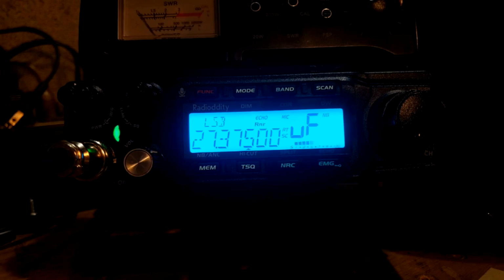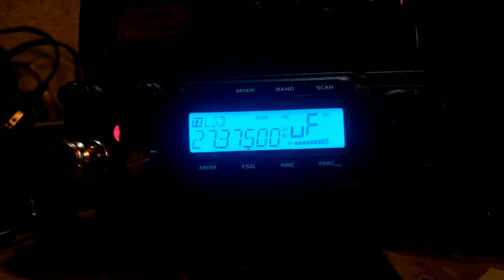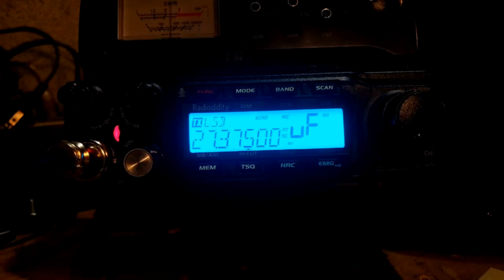No. Right now, I'm just running dipoles. I got a vertical dipole and horizontal. I got a co-phase pointing at you there. Go ahead. Copy that. You're giving me a strong enough signal, and it's so clean. I thought you were still on that 7-element. The new antenna setup is working well. Yeah, I've got the horizontal dipole about 20 feet. It's rotatable, and my vertical dipole's up about 50 feet. So we're running both of those at the same time. Copy that. You got them both going at the same time. That's fantastic. I love that kind of stuff. I love co-phasing antennas and stacking them too.